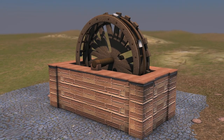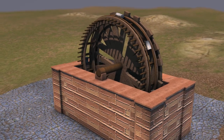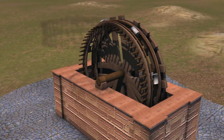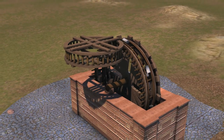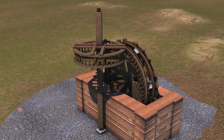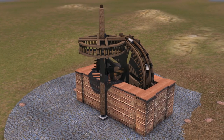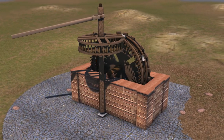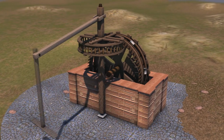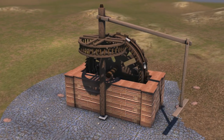The external surface of the outer wheel had wooden projections connecting the movement of the wheel to the movement of the reel abutting onto the wheel. The reel rotated around a vertical axle known as the spindle. The movement was transferred to the reel by a wooden beam, which on its end had a specially constructed projection on which an animal — usually a mule or a donkey, and rarely a horse — would be harnessed.